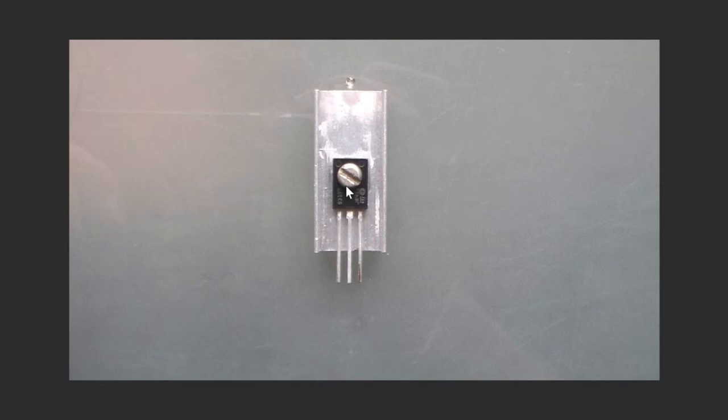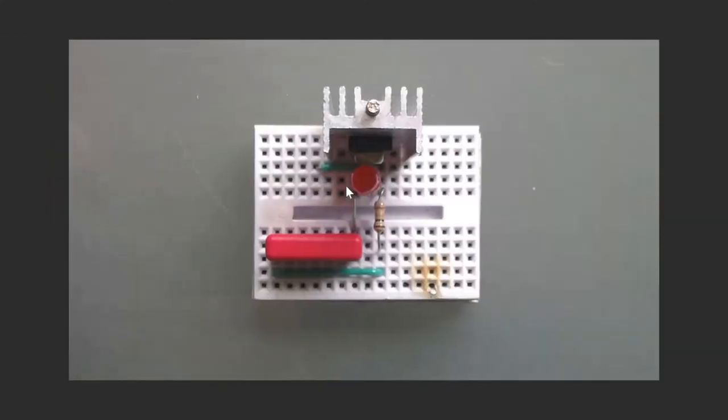So now let's see the circuit on the breadboard. Over here, I've got it set up on a little breadboard. So here's the resistor, here's the LED, and then here's the capacitor. So this rail over here is going to be the negative, and this is going to be the positive. And this is going to be for our feedback, where the negative connection of our secondary coil is going to go. Then our primary coil will be running from this middle pin over here to our positive pin, which is going to be either here or here. So let's connect up our coil and fire up the circuit.